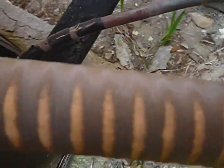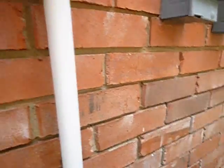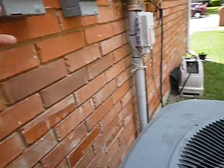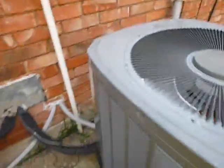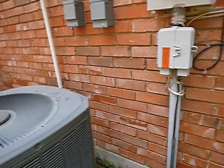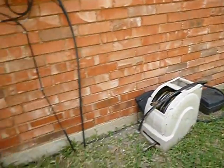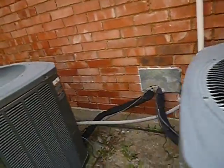These control wires are very susceptible to damage. This is probably the control wires for the lawn sprinkler system. The electric service disconnects — we cannot open these up to see how they're wired because the covers are sealed. Your electric service disconnect should not be behind the units. If this were installed currently, you'd also have an electric receptacle outlet out here so a technician could service these with power tools.